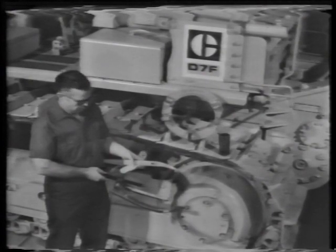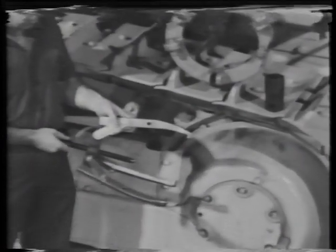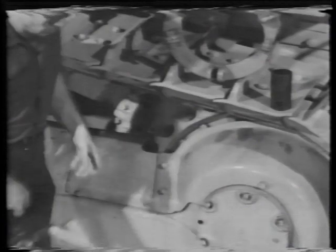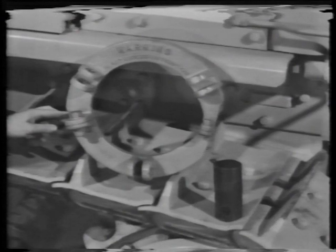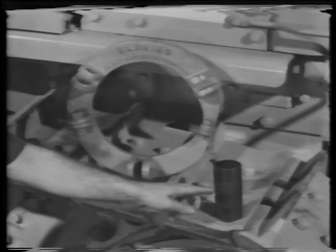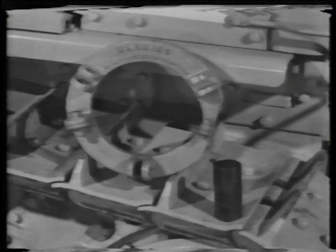Until now, this three-jaw puller has been used to remove the final drive outer bearing cage holder from track-type tractors. It can apply only about 7 tons of force. A new puller assembly and adapter can be used with a hydraulic pump cylinder group and hydraulic service tool attachments. Up to 50 tons of force can be applied.